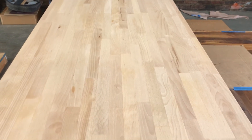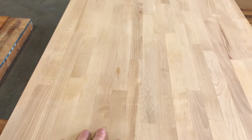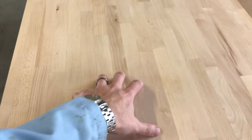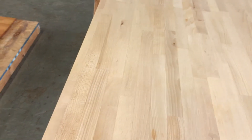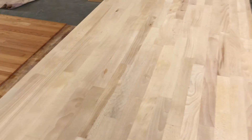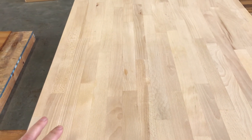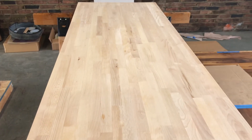Going above 150 doesn't really help much because we're going to put a finish over this wood surface — you're interacting with the Waterlox finish, not the wood itself. If you're ever sanding an actual finish you're usually doing something like 320 or 400. The only time you'd vary from the 100–150 range is if you're doing something with stain. You can sand to close off the wood more for less color, use pre-stain conditioners, or stop at lower grits like 80 or 100 to get more color. From here, the next step is to apply a sealer and then two coats to finish, and we'll have a nice birch butcher block countertop.